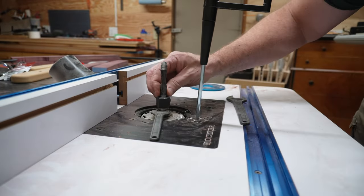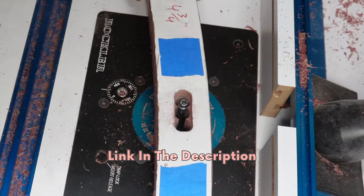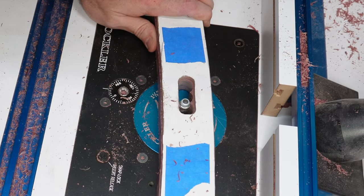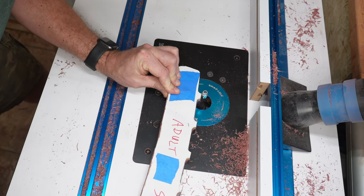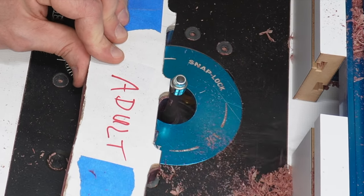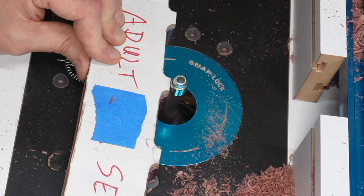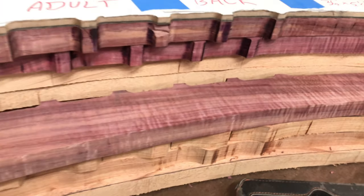This half inch spiral down cut flush trim bit has a half inch shank and a one and a quarter inch cutting depth, which worked out really well for this project. I'll leave a link to this bit in the description — it's not an affiliate link, I just think it's a really good bit. Notice here that when coming up out of this groove there is a potential for the spinning bit to catch the edge of these tabs and cause tear out. So I started each tab by coming straight at it about a quarter of the way in and then continuing as you normally would by running the work piece against the rotation of the bit. But then I came back and did a short climb cut on that leading edge. Look at that flaming curl — this wood is too pretty to be making nesting chairs from.